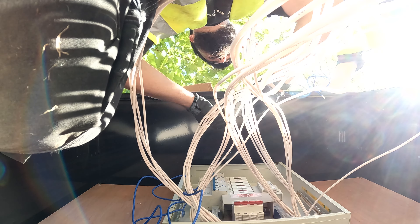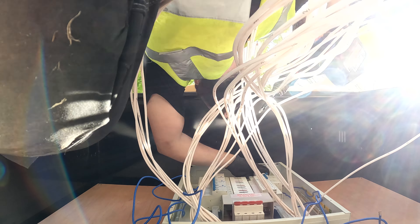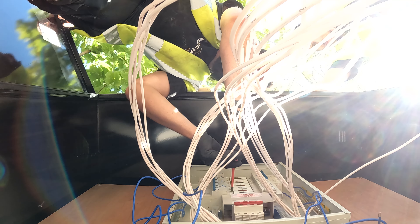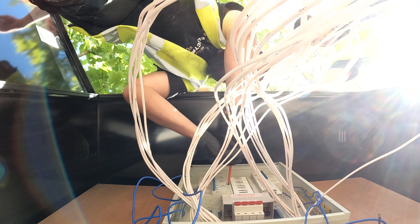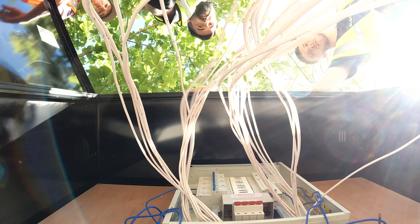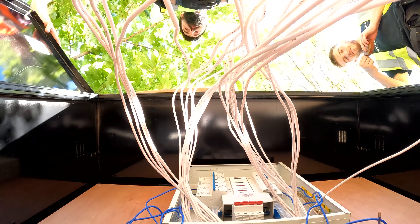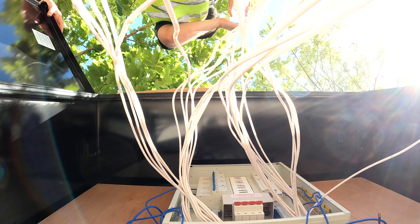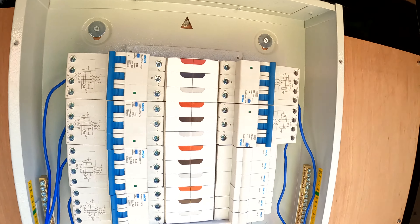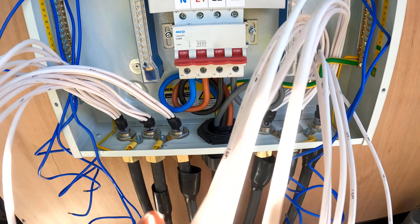This is the satisfying bit — getting that unwrapped. It comes with a little wrap around it. When stripping the cable, if you've gone deep enough, pull at a 45-degree angle — get your hand around it. You've got no more than this length to work with. If you bend it right over it'll snap the armour rings, so just give it a quick wiggle and it should come off nice and easy.